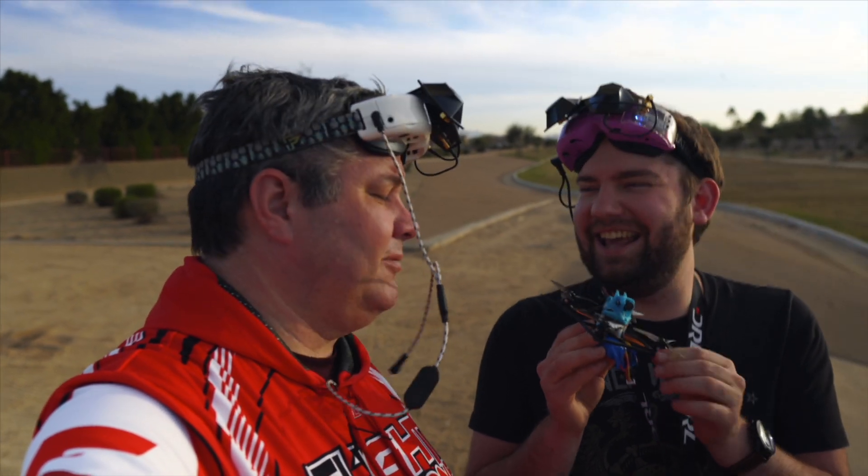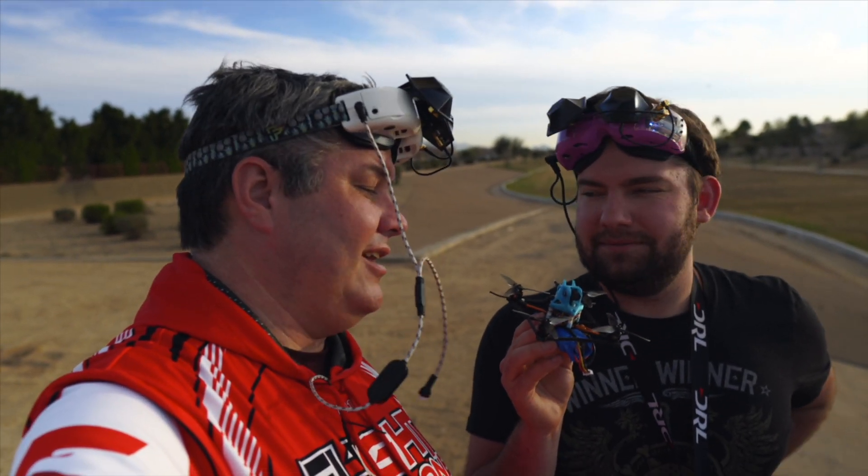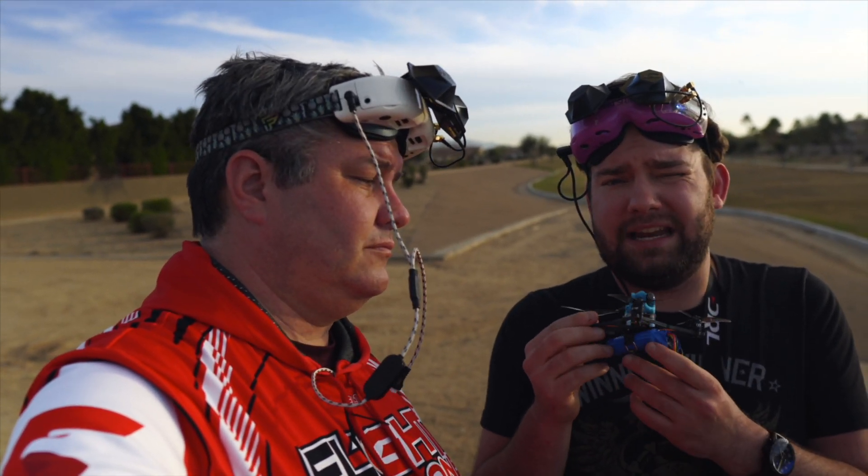I've flown this quad about 10 times already and I haven't been super easy on it. Something to learn from: if you have a quad like this and just one motor is bad, running hot while the others aren't, it's probably a good idea to replace it. That's probably the biggest thing that kills these toothpicks — the motors going out, which then kills the flight controller. Everyone blames the FC, but honestly if the motors die they're going to short it out. These motors just notoriously don't last as long as standard ones — they're just small and light. So if it's getting really hot and the others aren't, just replace that motor and it'll probably make the flight controller last a lot longer.